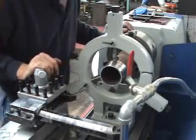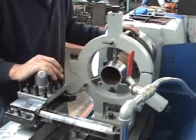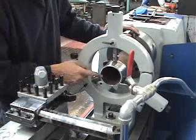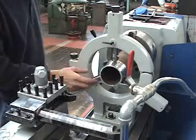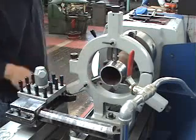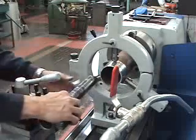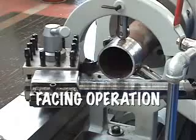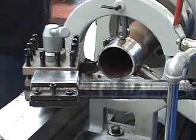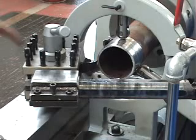What we're trying to do is take the cut out of the inside — we want to remove the seam. This is going to slip over another piece of pipe, so we've got our boring bar set up at the proper height. Because this was cut on the saw, we want to face it, chamfer the outside, then bore it out, and the final process will be chamfering the inside edge. I've got an insert tool for the facing and we'll switch over to the boring bar later.